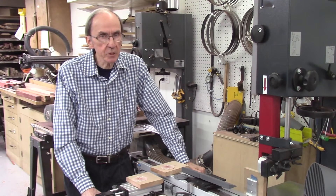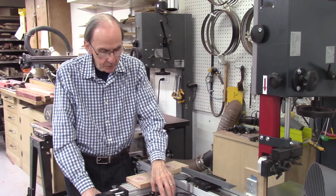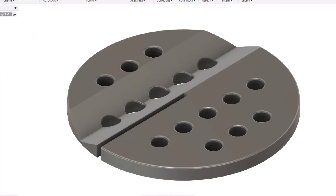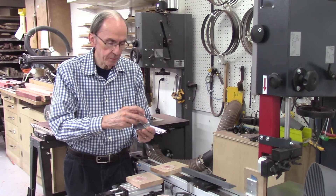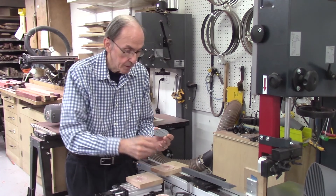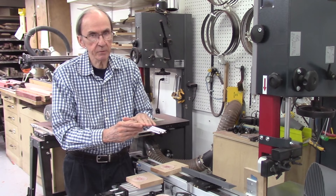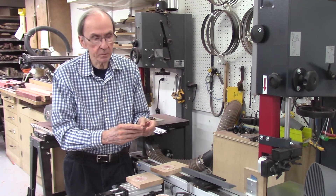This concludes the video of new accessories tested for use with my AccuSlice system. The first change was modifying the bandsaw table insert: narrowing the blade slot eliminated trapping of segmented discs, and adding a ramp to the insert made cut pieces fall off to the side. That worked very nicely, though I could only cut two or three segmented discs before they piled up against the blade and I had to push them aside. So my next idea was a larger external ramp, which allowed me to cut seven or eight segmented discs before they got too close to the blade — definitely much better.